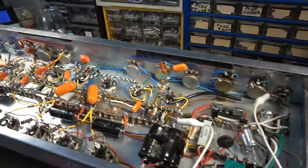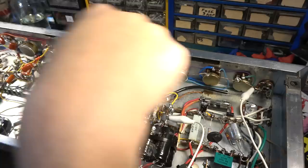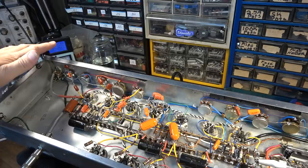That's kind of the way I have done it a couple times in the past, and in this instance it is entirely inappropriate. The way that this bus is originating at this end and being grounded over here at this input is fine if this is the only channel in the amp. That's perfectly fine. The problem is we've got this other channel over here with all of this noise.